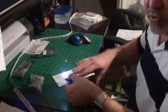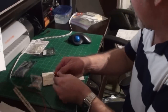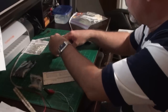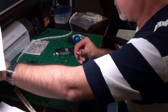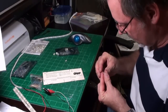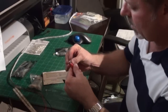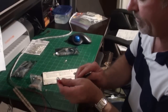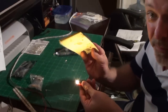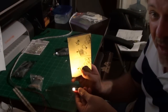There's no real spotlight to the flat top. The ultimate in this non-spotlight effect would be these piranha LEDs, which are fairly new on the market too. Finding the positive pole on it is different from a normal LED — I have to look at them. Got my positive hooked up, got my negative, turning her on — there's the piranha LED. You notice there is no LED spot effect. These are even better than the flat tops.